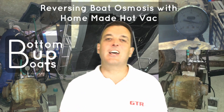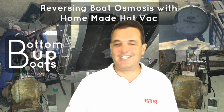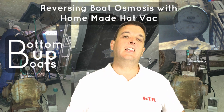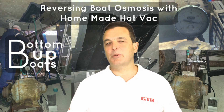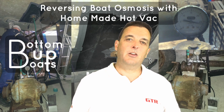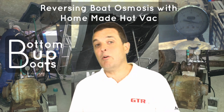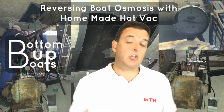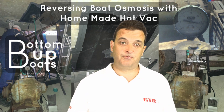So that brings us to the end of today's Mum 36 rebuild episode where we showed you how we reduced the moisture content in our hull for less than 100 pounds. Ultimately the cold Northern Irish winter and a vacuum pump that was a little bit past its prime prevented us from being 100% successful, but we did get significant reductions. I'm sure with a newer pump and warmer weather conditions you could really make a big impact on your hull without getting professional help. If you liked today's video be sure to subscribe to our channel to get future updates as we continue our Mum 36 rebuild.